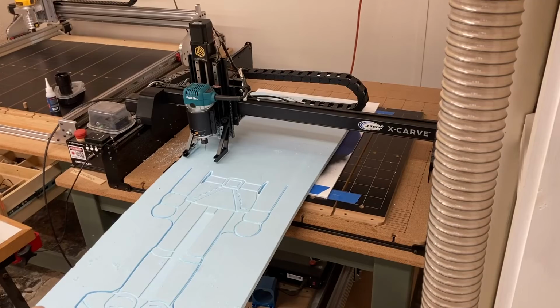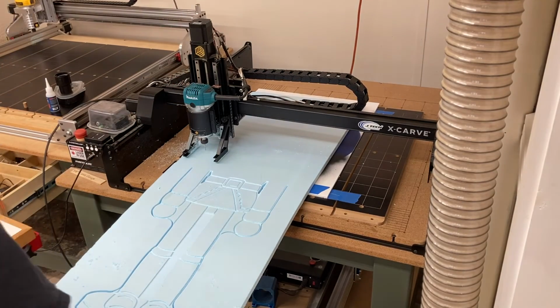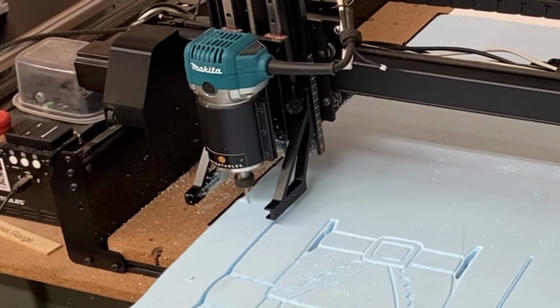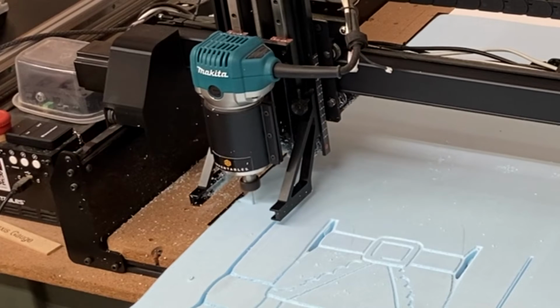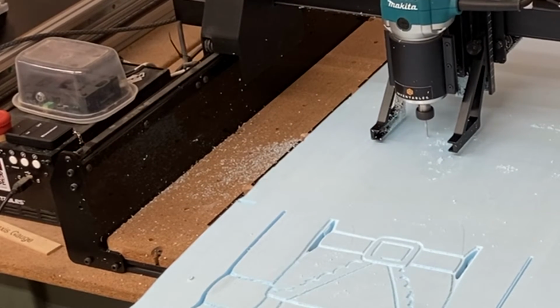I moved the project board down now to the 25 inches on the 0, work position, which matches exactly what's in the computer. I've gone through the checklist, and now I'm ready to carve. In the checklist, I'm using the last XY0 position, and when I hit carve, it actually goes over and carves that little reference mark. This is a verification that I know is exactly where it needs to be. I can stop the machine if it's not exactly where it needs to be at this point.